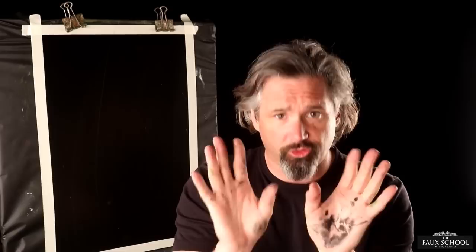So the first thing I've done to get ready for today's technique is base coated the surface. I base coated it with a product called Emerald from Sherwin-Williams. The color is Tricorn Black, and I'm using eggshell enamel. Pretty simple. I like eggshell over flat. I use eggshell enamels, or eggshells, sorry, I always say enamel just because it's a force of habit. Eggshell finish paint over flat.